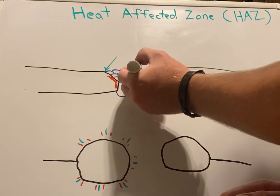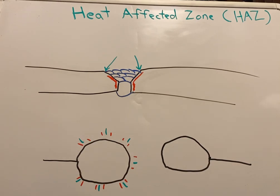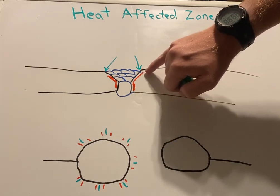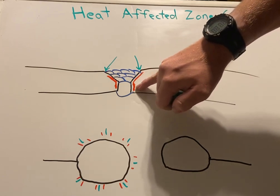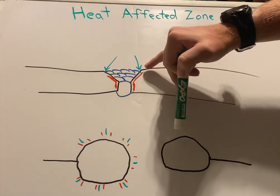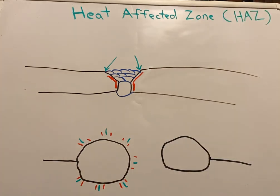These points, because they're not called for by the WPS, you can have cracking in there, especially if you have ordnance impacting that spot. That's going to really affect your heat affected zone. And so, like any other weld, you want it covering those corners. If you don't cover that, it's not structurally sound. They should be inspected. Some slip by.